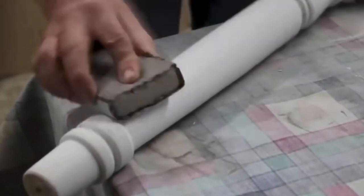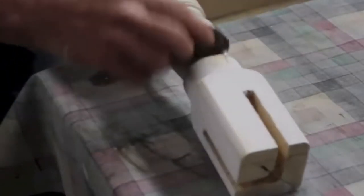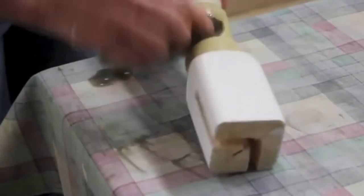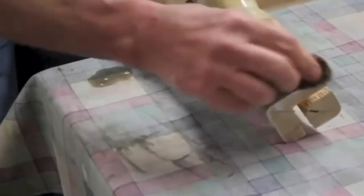And then the next little application is rubbing it down with a stain. In this case, it's Provincial, it's a Puritan pine, just to make it look a little more old and mellow, which the years would give it, but we have to make this look like an antique much quicker than the years will allow us. So I'm just wiping off some of the excess so it doesn't look terribly yellow, just a sort of a creamy white.